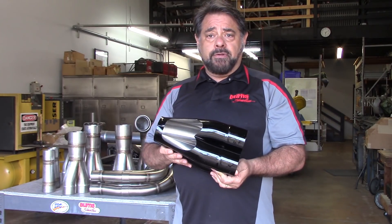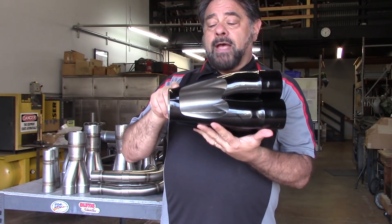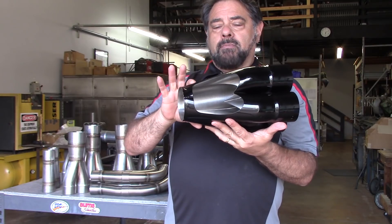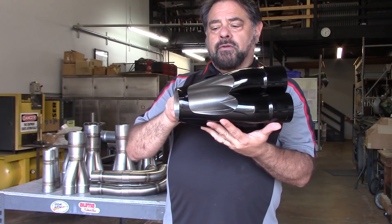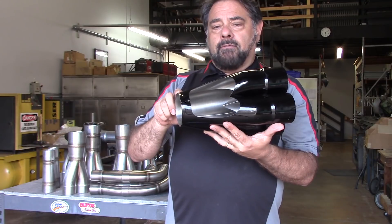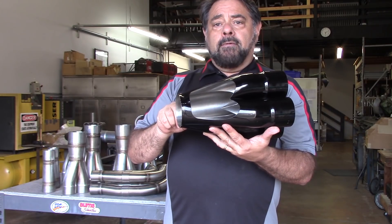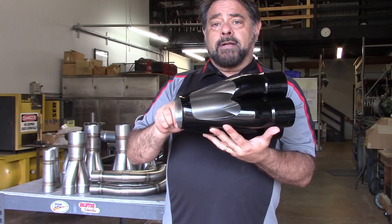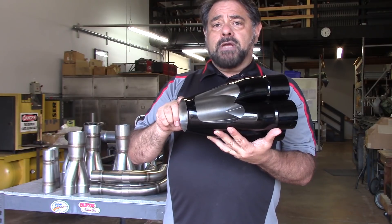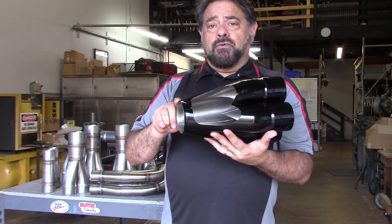The same principles apply to 3-into-1s, 5-into-1s, and 8-into-1s. One other key detail in this collector is the outlet profile: the way the outlet is formed, we begin transitioning from the merge angle out to the transition at the end of the collector. This curved profile has been carefully chosen, and we have special tooling to achieve it — that is one of the very unique things about Burns Merge Collectors. Collectors from other manufacturers often have a very abrupt transition in this area, and in exhaust flow it's very important to make these transitions as smooth as possible.